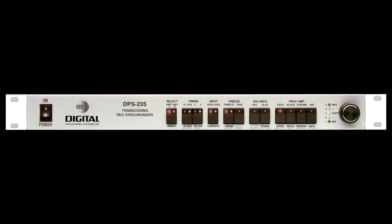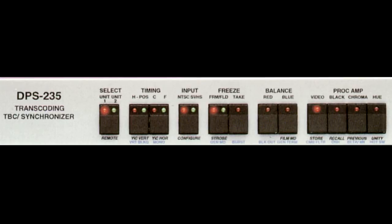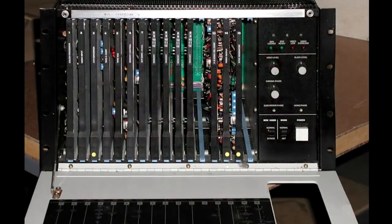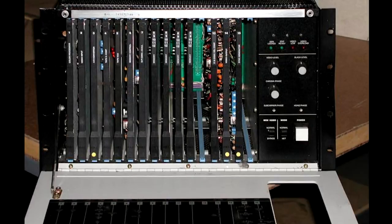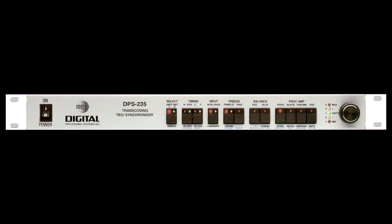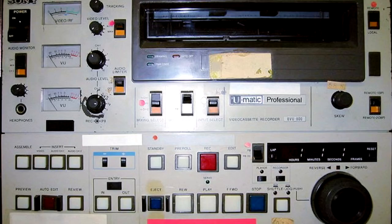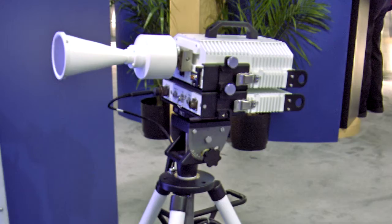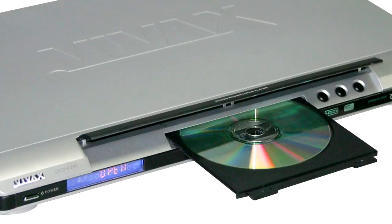Because we could store so much video in these boxes, they often had the ability to correct time-base error from videotape machines as well. Eventually, all frame synchronizers could do this, and we called them time-base corrector frame synchronizers, or TBC frame syncs for short. If you are still using analog video in your production center, you probably don't have a dedicated TBC anymore. You are probably using a TBC frame sync to correct incoming videotape playbacks, as well as external feeds like satellite receivers, microwave feeds, and even things like DVD players.